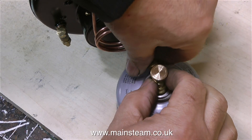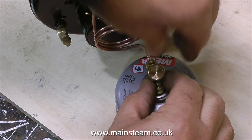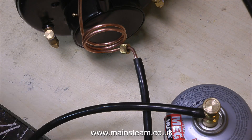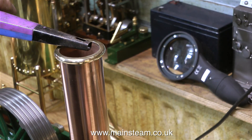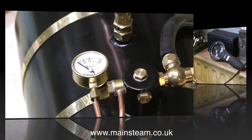After about 10 minutes no steam was being raised, so I thought I'd fit the pipe to an external commercial tank using the fitting supplied with the kit — but unfortunately the thread of the fitting doesn't match the pipe, which is a bit weird. I phoned Stuart Models but no one answered. At this point I noticed a faint glimmer of steam coming out of the pipe attached to the tap on top of the boiler. The oil visible didn't come from the boiler — it was in the pipe to start with. I changed to a fuller gas canister and re-lit the gas using an electric spark.